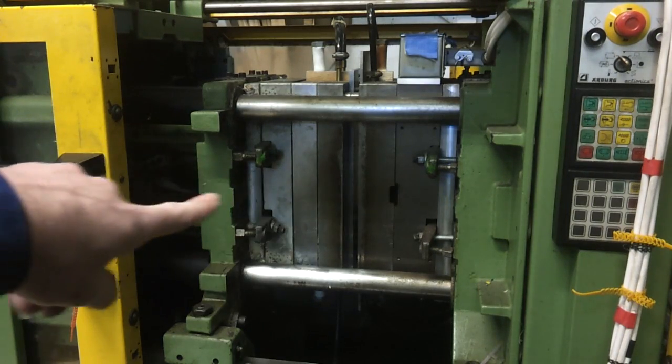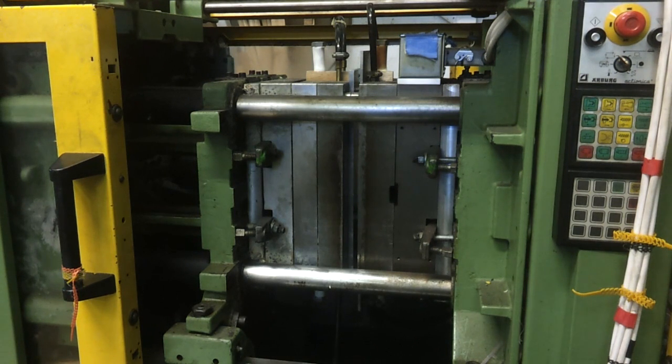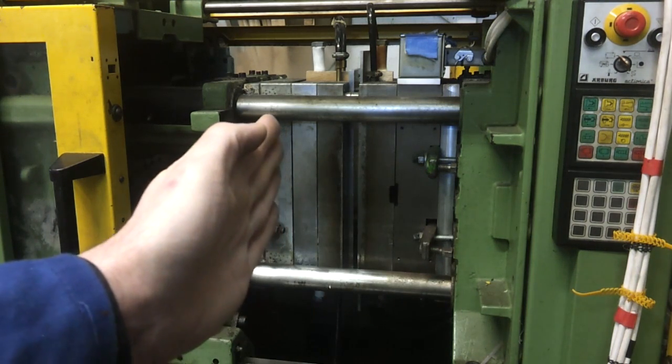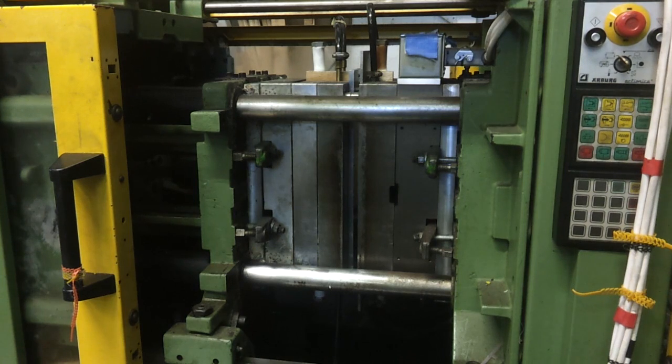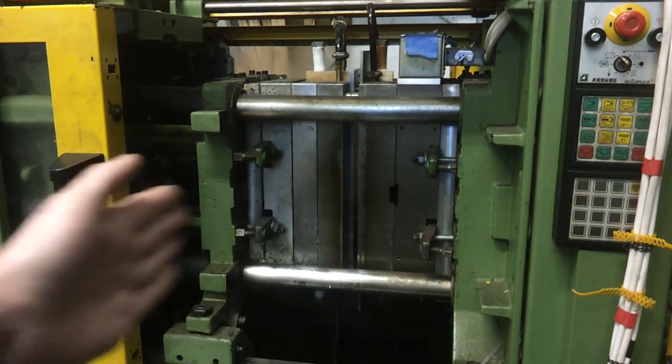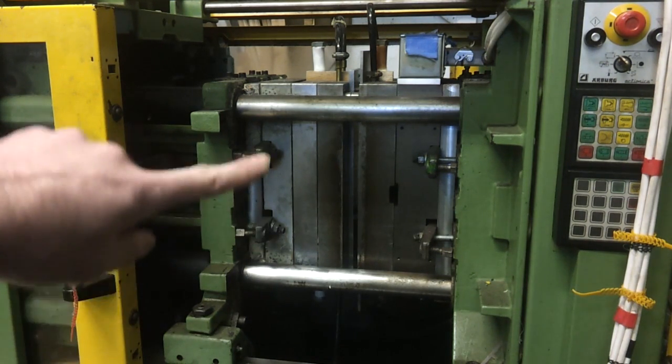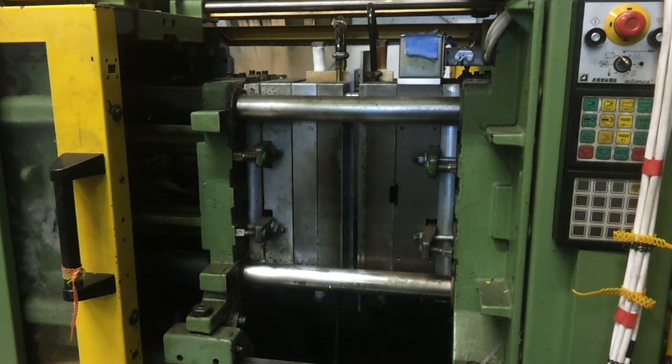The other thing you need is a mould base. This is a professionally made injection mould which actually cost about £15,000 when I had it commissioned, and today it just sits in the machine and gets used as a blank bolster onto which I fit those little mini moulds. There are a couple of face plates attached to the front here on both sides, and I can just come along with a small mould, bolt it on, and that gets the job done real quick and simple — means I can swap moulds out very easily. You can put together something like this for a few hundred pounds. These platens don't close fully; there's a minimum daylight, as they call it, and you have to take account of that. Rather than making all of this every time you want a new mould — that's the expensive part — you just have a dummy mould in there and then fit your small mini moulds onto it, which greatly simplifies the procedure and means you can do all of the expensive work at your leisure with just a small CNC machine.